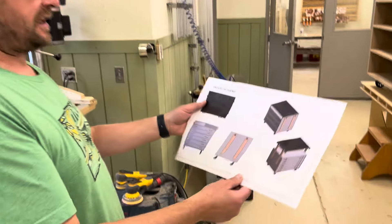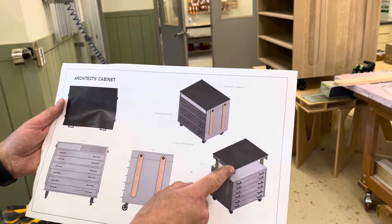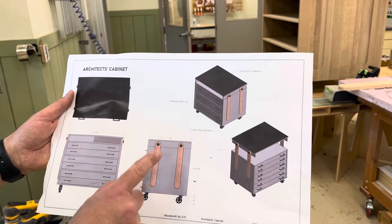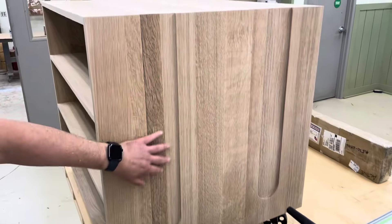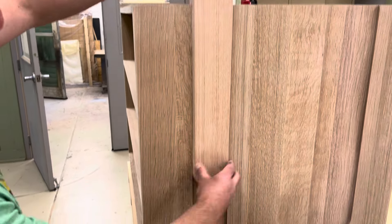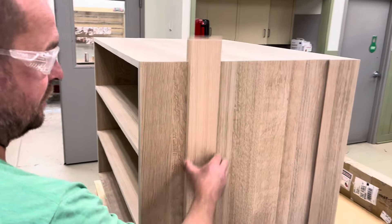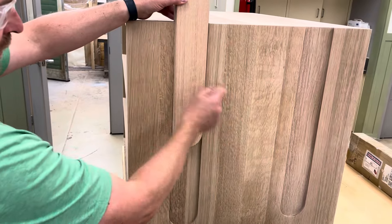Focusing on some of the design aspects, this project has a top that is able to lift up and down and adjust to different heights, which incorporates two legs on each side. These legs fit inside a dovetailed recess. There's a test piece — not the finished product — just to test how well it operates. The dovetail is facing outwards so that it will trap these legs in and enable them to slide up and down nicely.